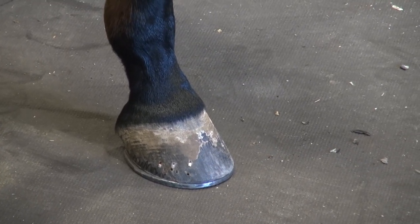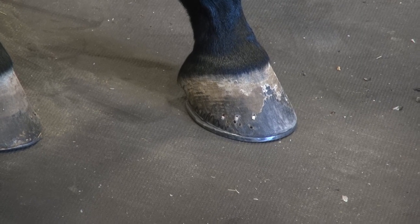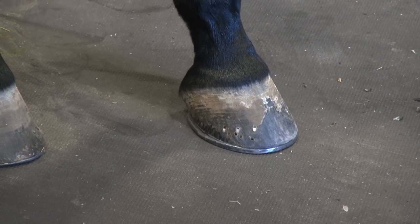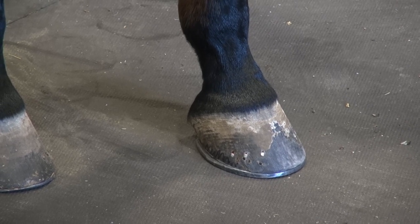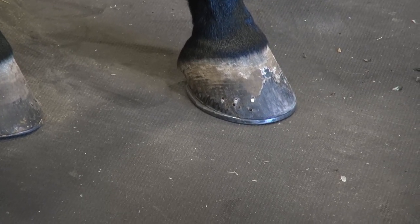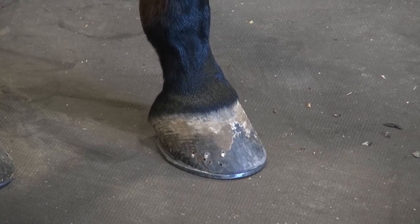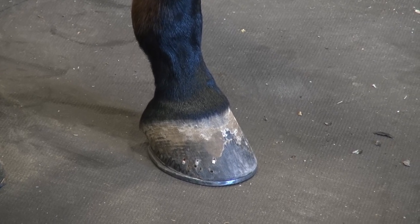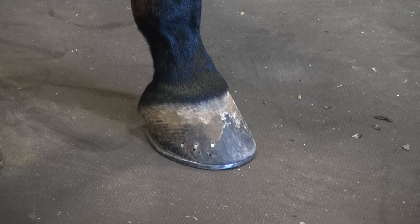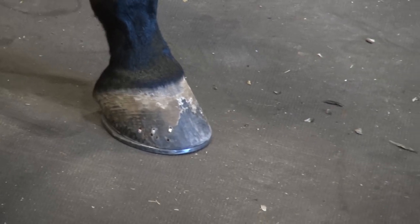Good idea to have your ruler measure your feet. It's amazing how high 1/3 is, higher than most people think it is. The alignment in the book now says the nails exit the hoof wall in a straight line parallel to the coronary band. It did used to be a question, could it be parallel with the ground or the shoe? It did used to say that in the book. Now the CAN definition is in line with the coronary band.